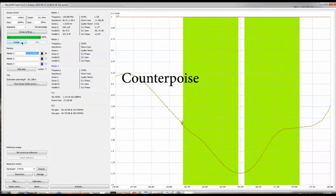And you can see that the change is also fairly significant, in that the scale might have confused you and you might think initially, oh, it looks worse. But look where our line of 3 went. It's way up here at the top of the screen now. And so our standing wave here is actually decreasing from 145, and the counterpoise makes the most significant amount of difference at the 155 level.